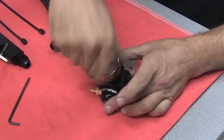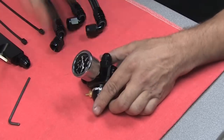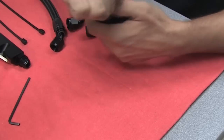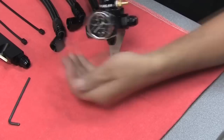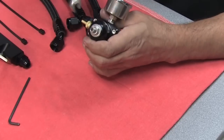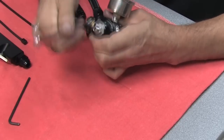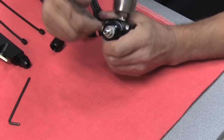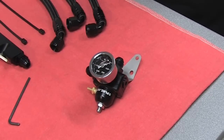This gets spun into place. The regulator is going to be oriented with the adjuster up, so account for that when you position the gauge. Probably stop with the gauge in an upright position so you can read it. Tighten this up — you don't have to get crazy. This is a tapered fitting; it gets tighter the more you go in. You don't have to bottom it out — just go until it takes a little bit of effort to turn it and that should be good and tight. That finishes up the regulator portion.